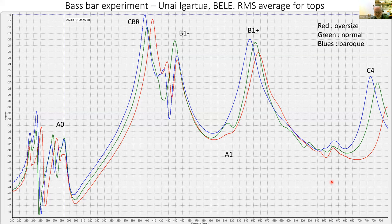But okay, so it's calculated, in other words, from in phase and out of phase motion. Yes. Okay. So you have to take these four measurements, and the reason I don't do it more often is it's rather tricky to do, because you can never make the two transfer functions identical. You're using an accelerometer, because you've got to move it from one side to the other. So they're not exactly balanced in mass.